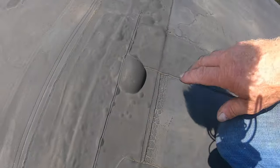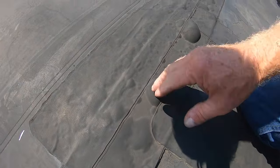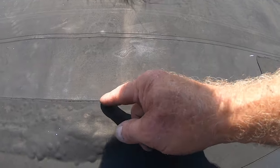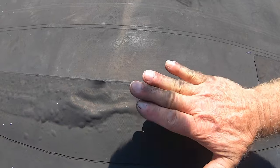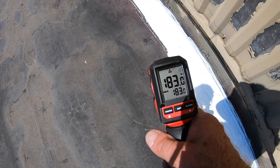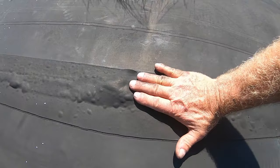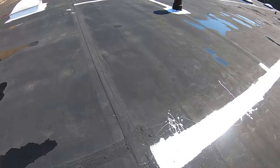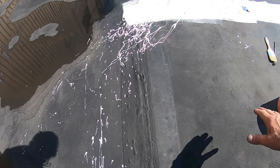So this uncured tape — what happens is the glue fails underneath it, look at it. You can see it, and then finally the seams open up like this. The seams open up because of the heat. It is so hot — 106, 148 degrees, 151 degrees, 182, 183 degrees. It's extremely hot and you cannot touch this right now, and this is like three o'clock in the afternoon. The roof fails because of the seams. This is a very thin EPDM rubber — the worst you can have — it's only 40 mil.